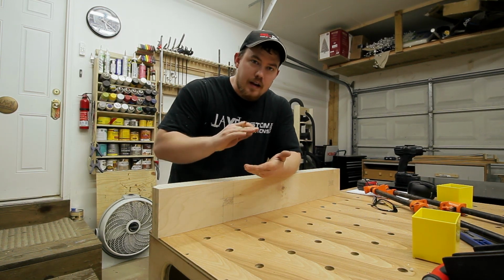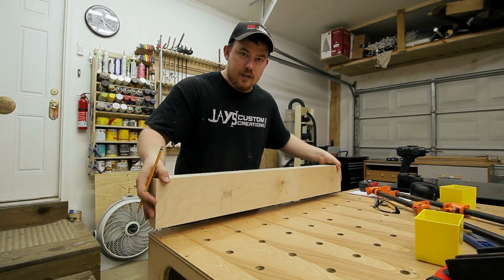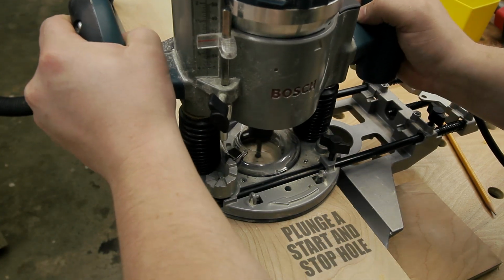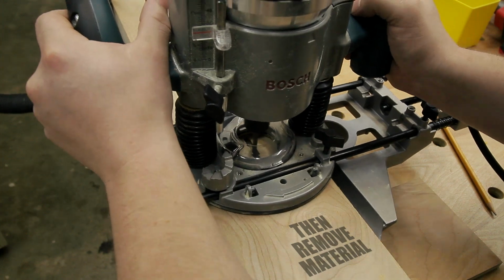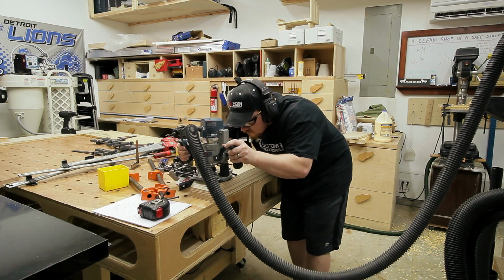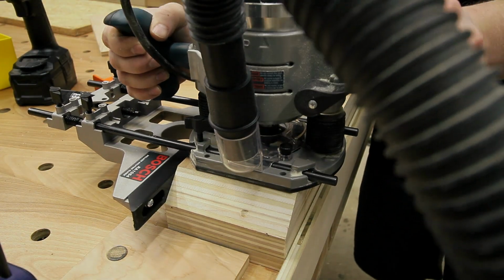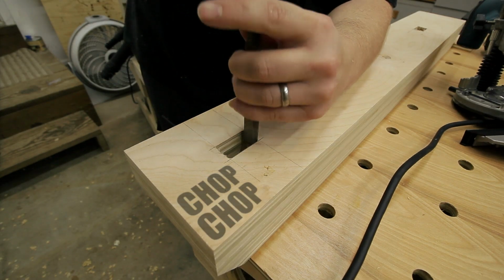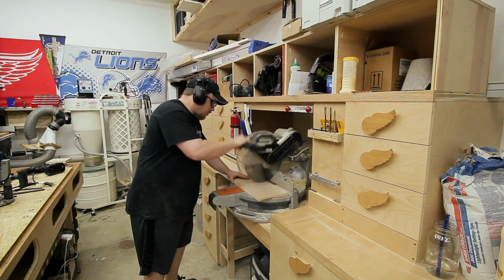The more gap that you have in between the pipe and the actual jaw in the vertical direction, the more chances are you're going to have this thing wanting to rack on the bottom side when you clamp something down. Before the final assembly, the stationary jaw can be cut to length and the holes drilled for the pipes.